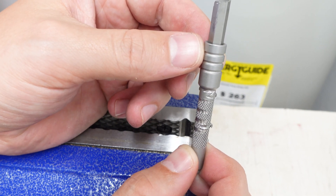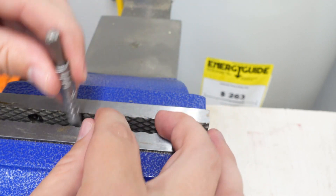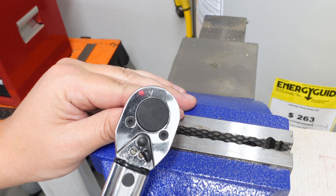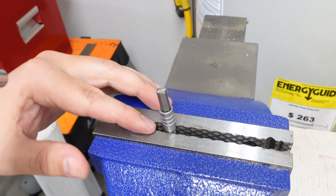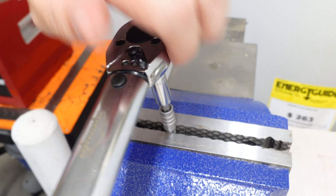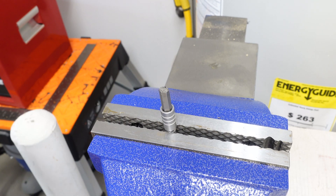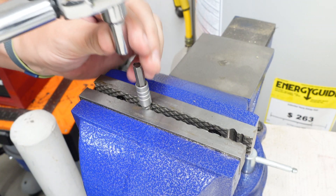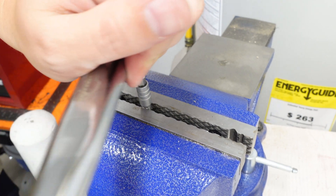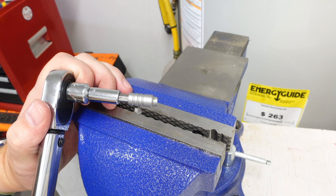This is definitely well beyond what you guys would be doing with the Leatherman tool itself, but let's go ahead and keep increasing and see how we do. I'm going to move this to the center of the bench vise so I can get a little bit better bite. We have the torque wrench set for 60 foot-pounds or 720 inch-pounds. I'm going to start going up in increments of 10 because we are starting to chew at the shaft a bit, and I really want to see the cup itself break. The Leatherman shaft is just slipping in there — I need to tighten it up even more. Take two at 60 foot-pounds — and we just broke it off at 60 foot-pounds of torque.